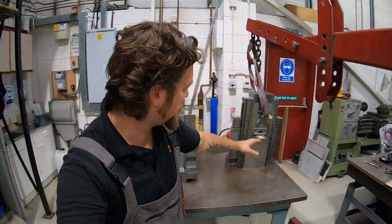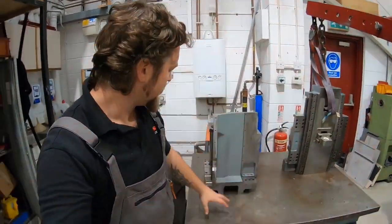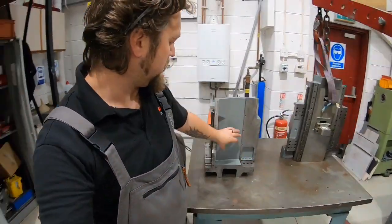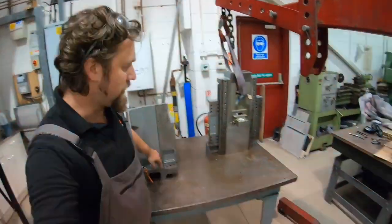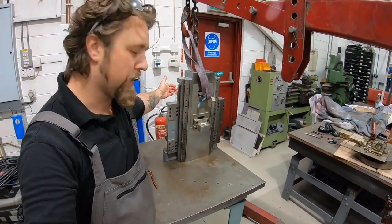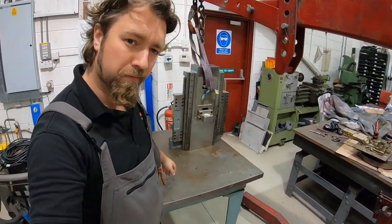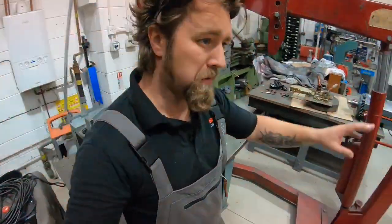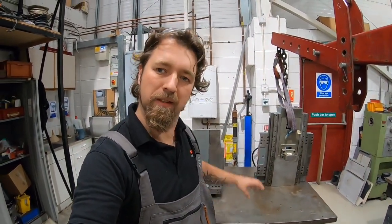That's the rails prepped. We've already got the Z casting and the X casting and the wire attachers on here. We're going to get these on — these were painted up yesterday. We've got to attach the X first from the back side because we can't get to the screws after they've been mounted. So we're going to do the X rails, going to fit the Z rails on the bed and then we're going to drop this into place and see how we get. Chuck the ball screws in, should be a good day.